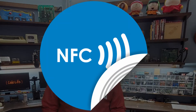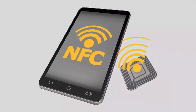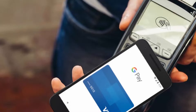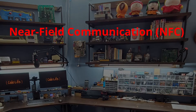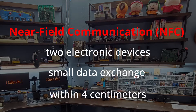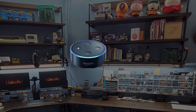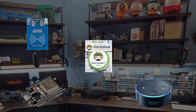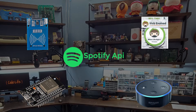So what is the magic inside this little box that makes it work? NFC. NFC, or near-field communications, has become very common in our lives. It can be found in badges used to open doors. Smartphones have built-in support for NFC as well, which allows for things like Apple Pay and Google Pay. Basically, NFC is the technology that allows two electronic devices to exchange a small amount of data when they are within about four centimeters of each other. There are five major components to this project: Amazon Echo Dot, an ESP32 microcontroller, an NFC reader, an NFC sticker, and finally, the Spotify APIs.